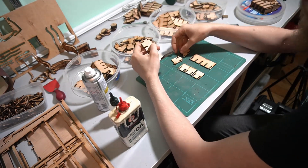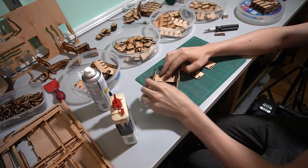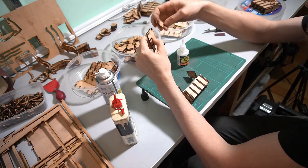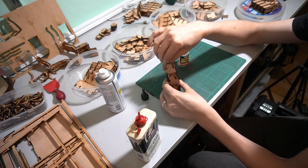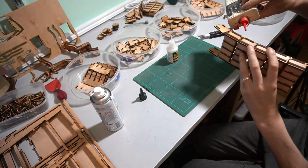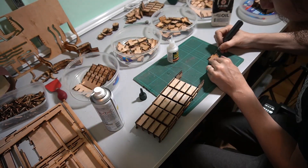After a little bit of mass production I started sticking them all together. I'm sticking the sides and the middle dividers to the side that has the pivots, but not gluing the top plate because it needs to come off later to get the cables in. You start by putting the sides onto the pivot at the pivot point and then put the next set on and work along that way. I'm super gluing along the join at the bottom on the base plate and putting a little lubricant on the wooden pivots so they're less likely to break off. I constructed these in sets of five so they didn't take up all my desk space and so the weight of completed sections wasn't on the joints of ones still setting.